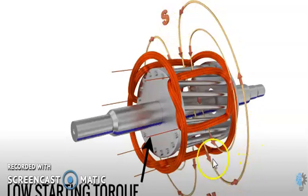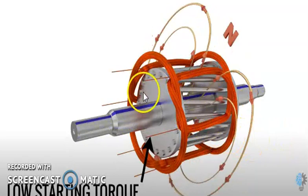This is a totally magnetic field — the rotating magnetic field is simply called the stator field. Due to the magnetic field, the current is induced in the rotor conductor according to Faraday's first law, which states: whenever the conductor cuts the flux, EMF is induced, and accordingly current flows. So the rotor conductor interacts with the stator flux — the rotating magnetic flux — and according to Faraday's first law, EMF is induced in those conductors. Once the EMF is induced, the circuit is completed through the end rings. Hence, because of this EMF, the current will circulate through the rotor bars, and once current circulates, applying Faraday's second law — whenever the current carrying conductor is kept in a field, it experiences a mechanical force — my rotor starts rotating.